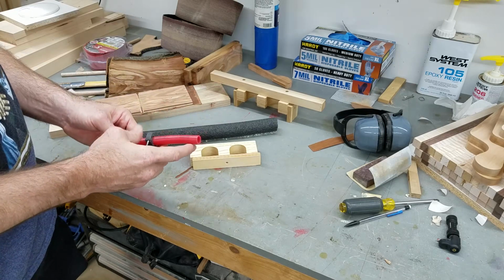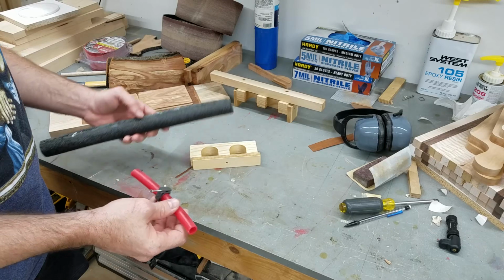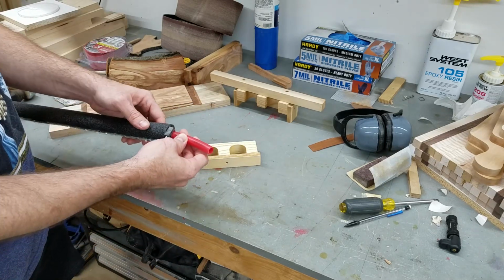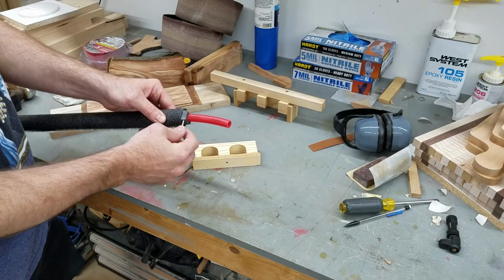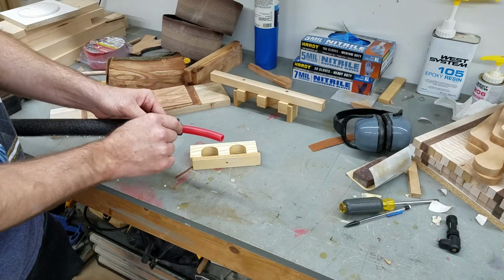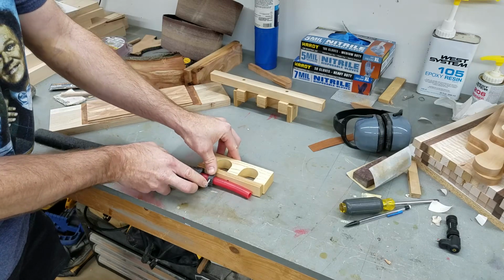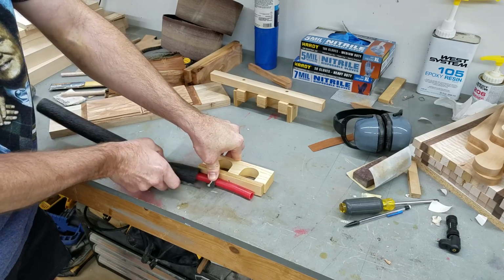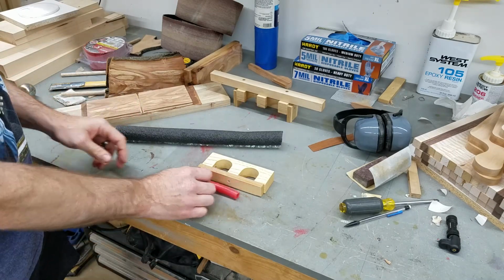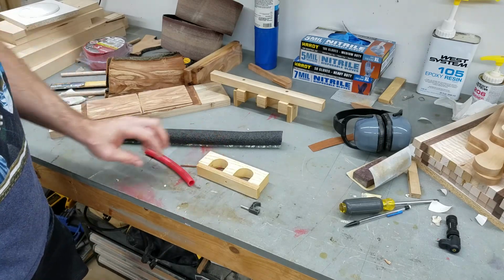And that's fine in most situations, especially when you're inside a house, but in a crawl space, or inside a garage, I wanted to make sure that the pipe was insulated. And what you usually end up with is the insulation going around your clips like that, and you cut to go on the other side, so you just end up doing a lot more cutting of your insulation to fit around the clips. And then if it's right up against the joist this way, it's even trickier to squeeze your insulation in there, so you have to cut it to make it fit. It's just a huge pain in the neck. And I thought, why aren't these things big enough so that you can put the insulation and the pipe in at the same time? So that's what I got right here.